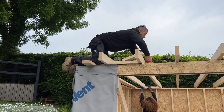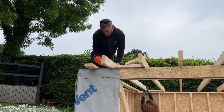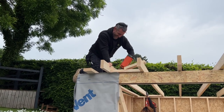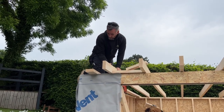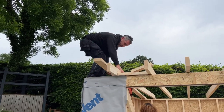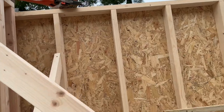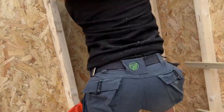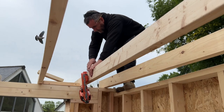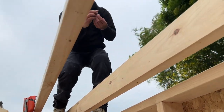I did some work yesterday on my new project and I'm more than happy with how it turned out — that'll be up for raffle soon as it's completed. Last one now. Obviously your timber falls where it falls on the last one — you won't have your exact 400mm spacing — and if you're slightly out it's not the end of the world either, it'll just mean cutting your insulation tapered.